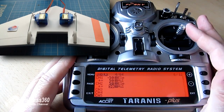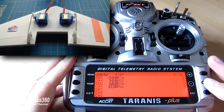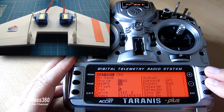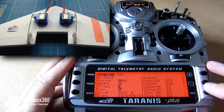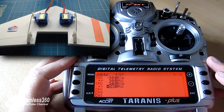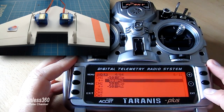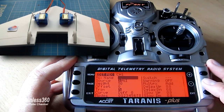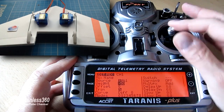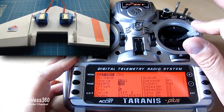The way the aileron should work is: if I go to the left, the left aileron should come up — but those are the wrong way round. To change that, edit and change the polarity of the 50%. Do the same on the other channel as well. Now we can see that the aileron and the elevator are both working in the right way.